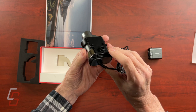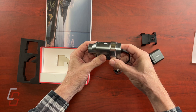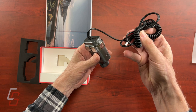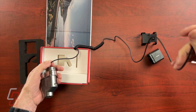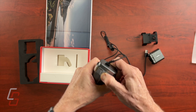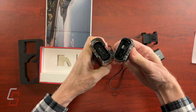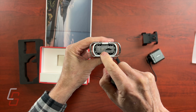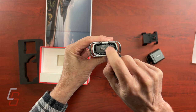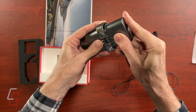We're going to remove this mounting clip and take a closer look at the camera. It has a back on it with a power cord — actually a USB cord — which allows you to connect to an external power bank. Or connect it to your motorcycle if you have a USB connector. This back does come off; you release these two little clamps that just pull out, and then you can pop the back off the camera body itself. Here you can see the USB-C port used to connect to the power back, and the microSD card slot on the other side. If you want to run on battery power instead of USB power, you simply use the battery pack — it connects the exact same way. You just push it together, close those little chrome clamps, and you're ready to go.